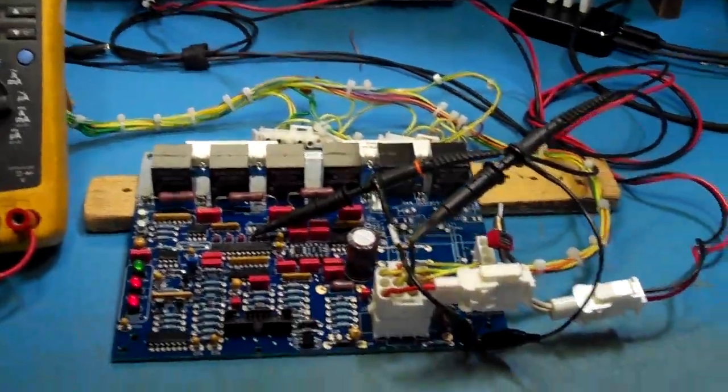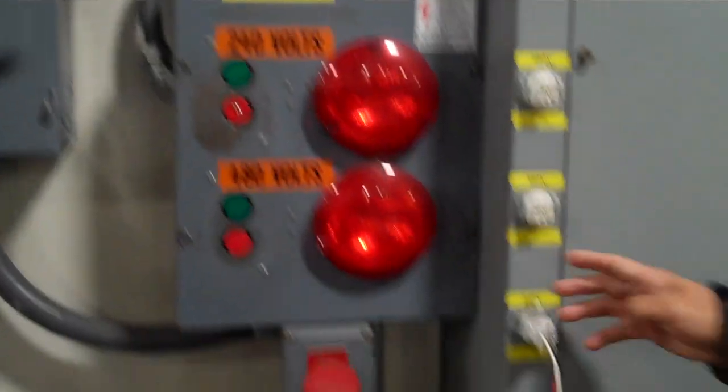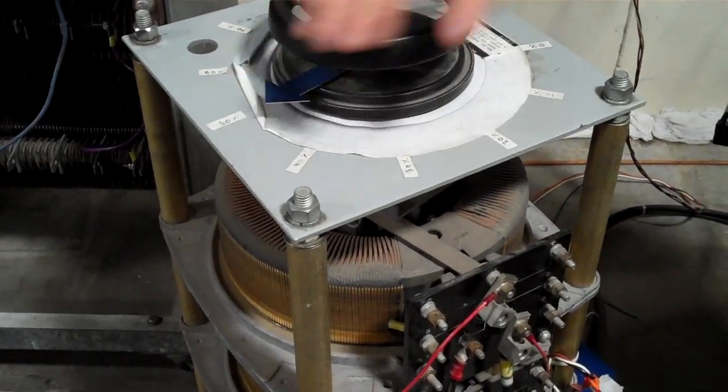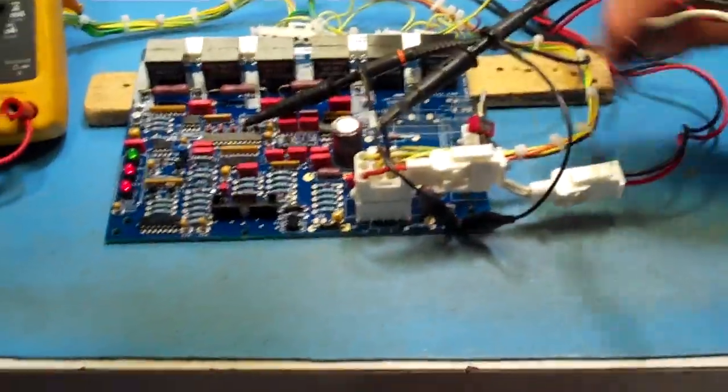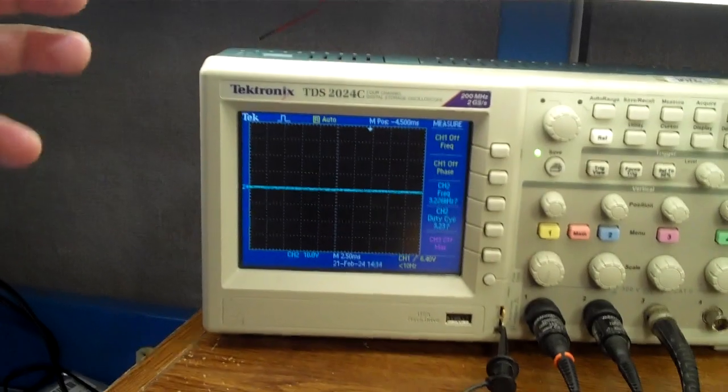So now we are going to bring in from the 240 volts, we're going to use our Variac. We've set it already to about 48%, so that we bring here our phase references via J5. Go ahead and plug it in, Tony. And we see here that the board hasn't been upset.